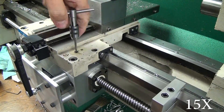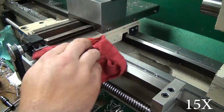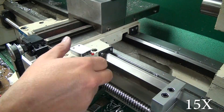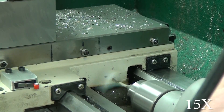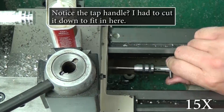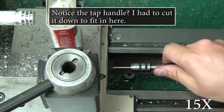I'm not going to show how I wired this onto the breakout board, but it just goes to one pin: five volts in, then back to ground. LinuxCNC can be set up with as many switches as you have inputs, running each to its own input. I'm doing it this way because on my breakout board I'm very limited on the number of inputs, so I just wire them together on a single input.